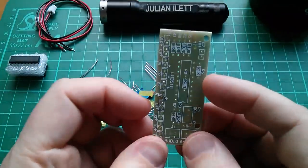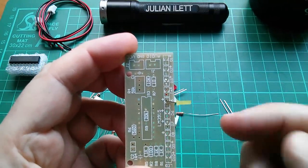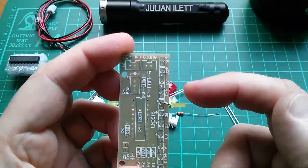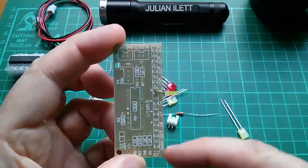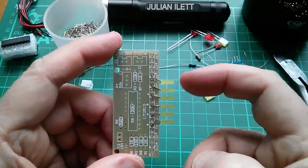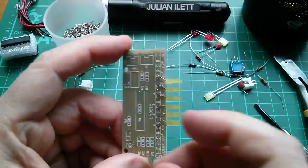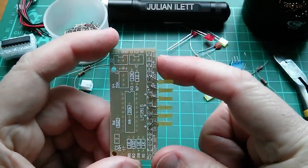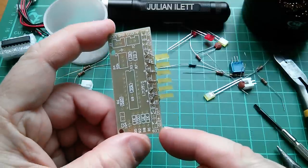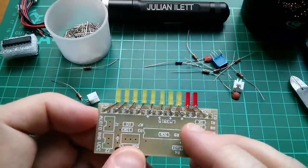I've mounted the LED straddling both sides of the PCB, set ever so slightly offset from its nominal position. I'll put another one next to it and slightly angle each one in to create a line of LEDs that doesn't extend the full length of the PCB. You can see what I'm trying to achieve — the bars are across rather than end-on-end — and I'm hoping the total bar length will fit in the slot on my front panel. D10 and D9 at the top are red, so I must be careful not to mix those up.